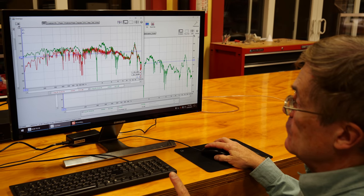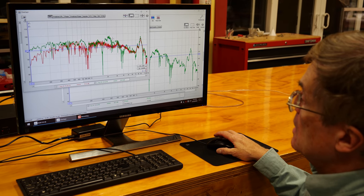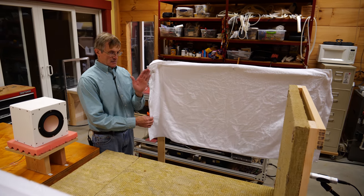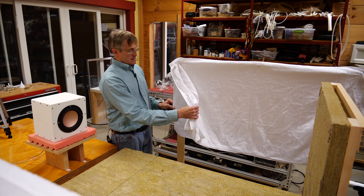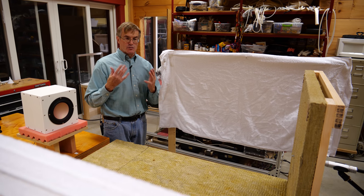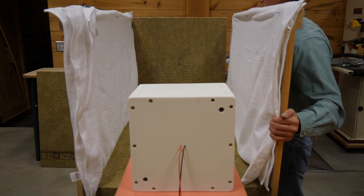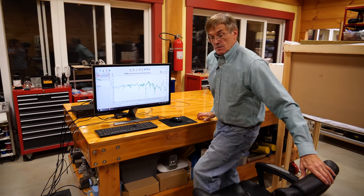Now we're going to add something to reduce reflection noise. Like the YouTuber DIY Perks, who analyzed bath towels, we decided to test them at a glancing angle. I've taken four inexpensive bath towels and attached them in front of those hard surfaces — similar to what you'd have if you put this material directly in front of drywall in your home. Let's put these back together like they were in the previous test and see what the towels do.